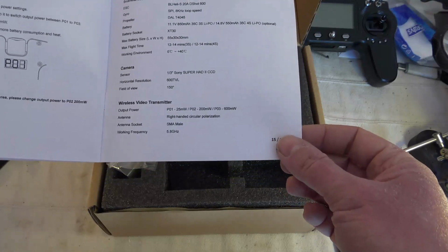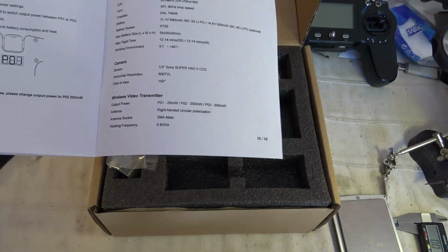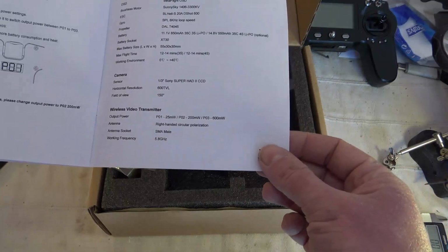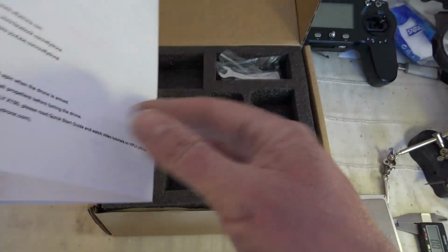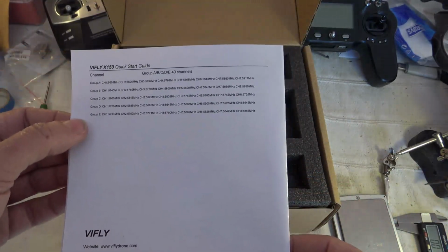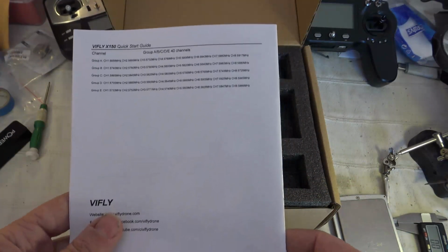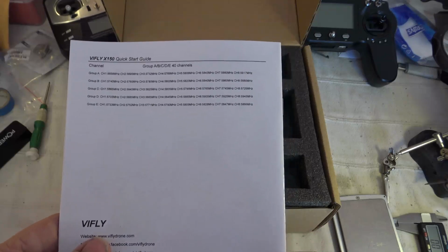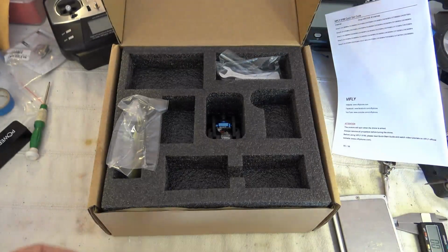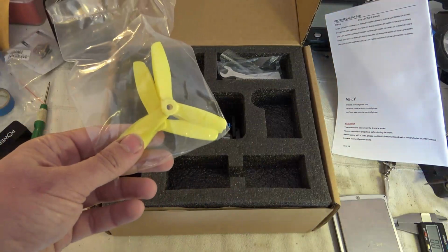So the good news also, the video transmitter is a 40 channel, the same as the two former models, with the output power configurable from 25 milliwatts up to 600 milliwatts. And you have the list of the 5 supported V-bands, each row corresponding to a V-band and associated with the 8 V-frequencies. So you have to know that you will have to cycle between the 40 channels, no V-band sub-selection first.